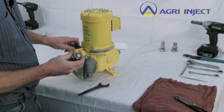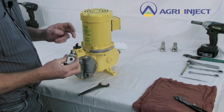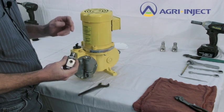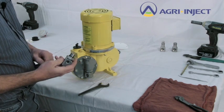You should be able to hear the balls rattle inside of the housing. If you do not hear it rattle, we need to flush it out. Usually warm water works best. You can clean it out with air pressure blowing through the direction of flow, and then blowing in the opposite direction to make sure the ball seats.